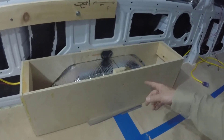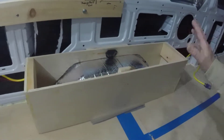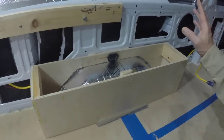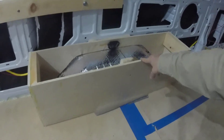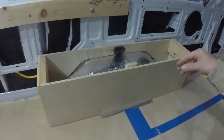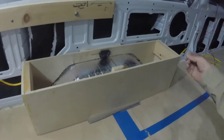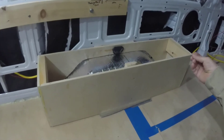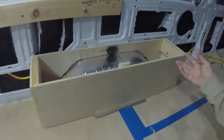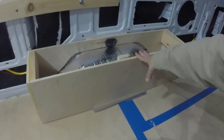I made three revisions of these things. The first I made out of two-by-two framing and was just going to cover it with plywood — that didn't work out, so I scrapped it and threw it in the burn barrel. The second version I made out of half-inch standard plywood using the Kreg jig pocket hole cutter for the joints. I'm not a fan of the Kreg jig for half-inch material — anything three-quarter and bigger I really like it — so I went to a third revision.